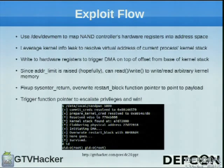The gist of it is, poking and prodding hardware registers like this is never a good idea, and in this particular case, it conflicts with the driver's usage of this hardware. When you trigger the DMA, the hardware sends off an IRQ saying, oh, I'm done doing DMA. The driver receives it and goes, why did you just tell me that? I didn't ask you to do that. And on Linux, the default response to a spurious IRQ is actually to ignore that IRQ from then on. So at that point, your NAND flash controller can no longer perform DMA and your primary storage goes down and the box is totally useless until you reboot.